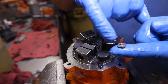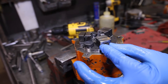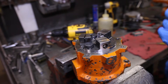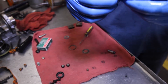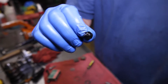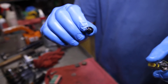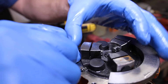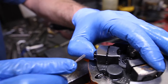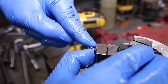Next, insert the new delivery valves, making sure that the nipple is facing outward. Grab a pump seal with your spring guide in place — hold it with your thumb on the back and your fingertip on the spring holding it in place. Have a small flathead screwdriver nearby. With one finger, hold the RAM in place while the other pushes toward the delivery valve. Take the flathead screwdriver and gently push on the edges of the seal until it is completely in. You can then push it flush.